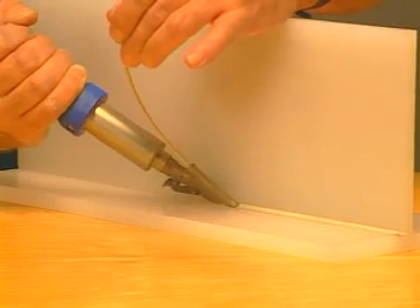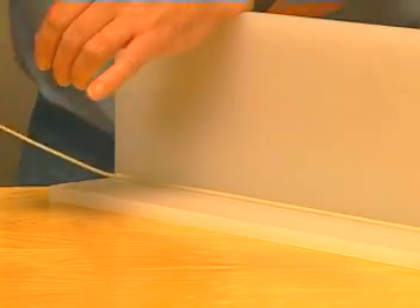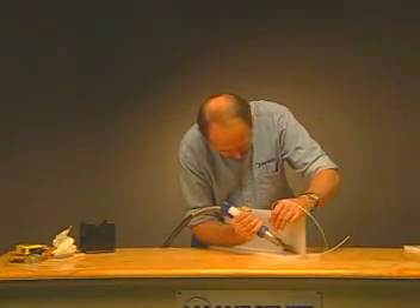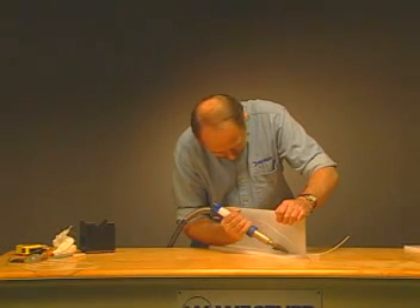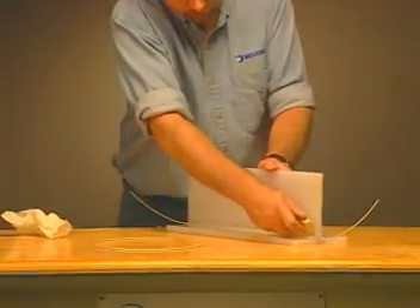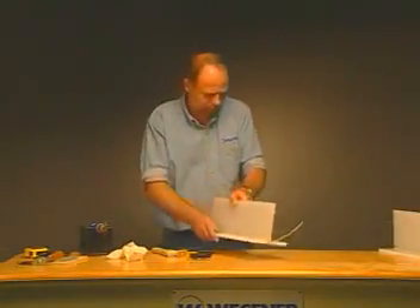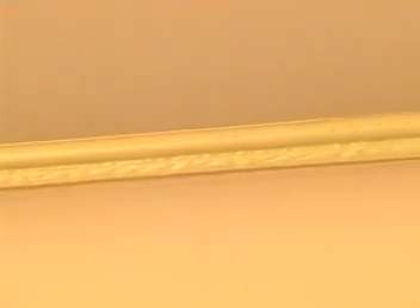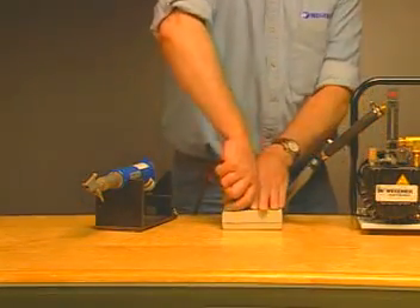In this application, the welder is at a 45 degree angle. It is essential that you keep pressure on the welder until the very end. Repeat this procedure on the opposite side. Alternate this procedure from side to side until the proper number of beads has been applied as described in the Wegener guidelines. For the best quality weld, it is imperative to scrape the weld area just prior to laying down a new bead. Some visual inspection will help to evaluate the quality of the weld. An even haze line should be visible right next to the entire weld area. There should be no sign of splashing and a small ridge should be noticeable at the edge. When finished, unplug the gun and allow the heating element to cool down for a few minutes before turning off the blower.